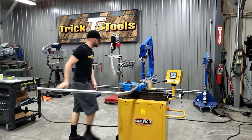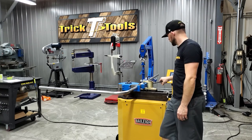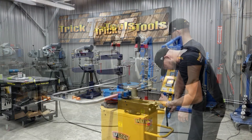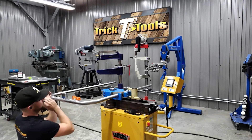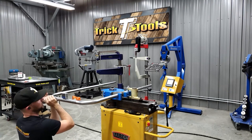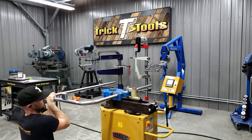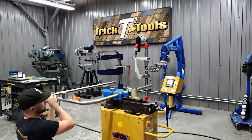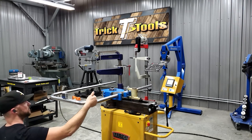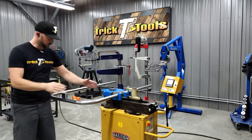Give a little bit of up on that, check it again — I'd say we're pretty good. The tube dropped a little bit down when I did that, so I'm going to give it a little bit of tweak here just to make sure. And there we are at 0.35 degrees with it up this way, so this way we are completely level with the die.